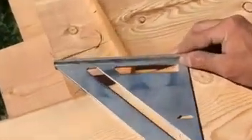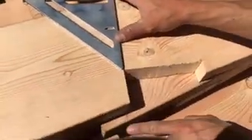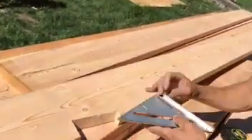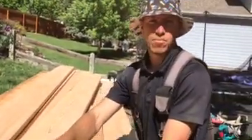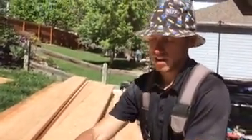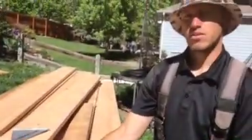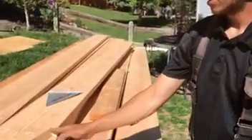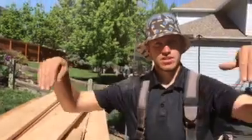Go off your mark at 14.8 degrees, come seven inches down, make your mark there, and carry that angle through. You can either put a framing square on here to get the square cut, or come from this side and do the reciprocal angle — the reciprocal of 14.8 is 75.2 degrees. That's what I did with my big speed square: I set it on 75.2 to make that nice and square. Then I made sure that my bird's mouth cut was only the width of my beam — actually I went about 3/8 inches bigger than the width of my beam just so we have a little bit of play. We like to carry down this end of the bird's mouth because otherwise it would be squared all the way over and then it would be hard to attach our tongue and groove nice and tight to the beam.